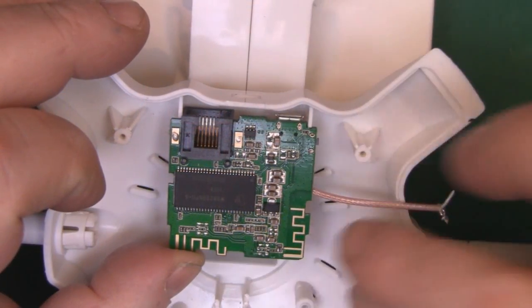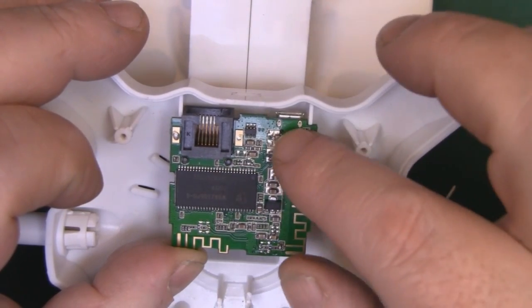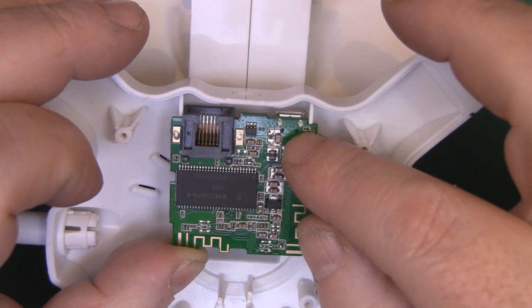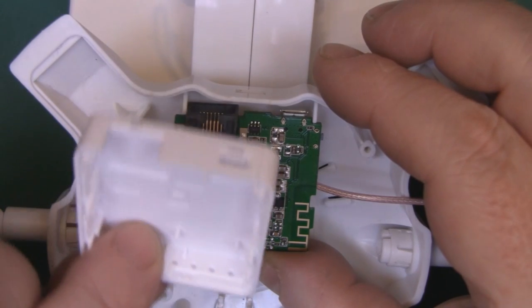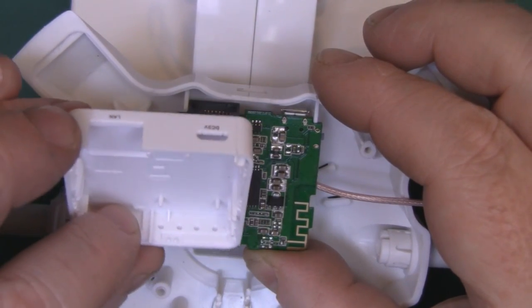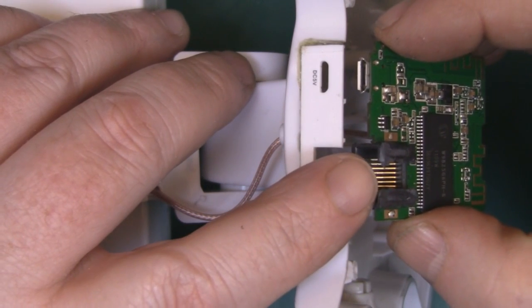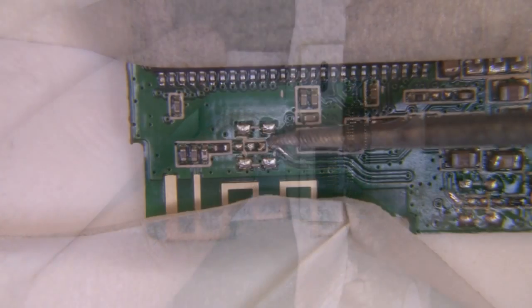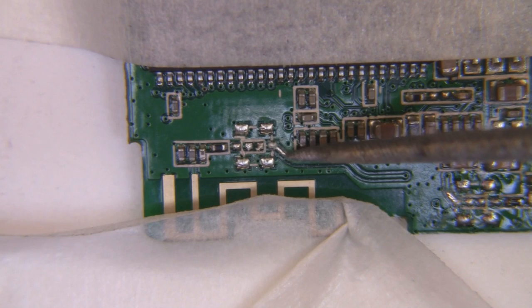Before modifying this board to solder coax onto it, I'm going to modify the antenna case itself. We want access to the USB power port - rather than drilling holes to accommodate that, I'm going to cut out a rectangle shape in the back of the nano router case and glue it in position, so I'm not messing around cutting out little shapes to accommodate the connectors. I've got that epoxy in place now and have also had to shave off a small amount of the LAN socket to lower its profile slightly so when we put the base cover back on it sits nice and flush. I removed that little capacitor so the signal path to the F antenna is now broken.